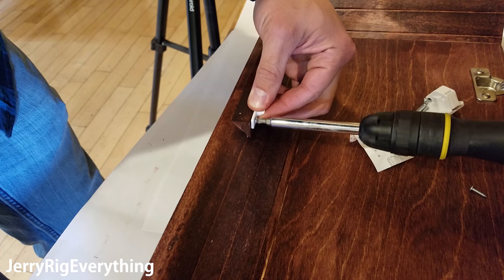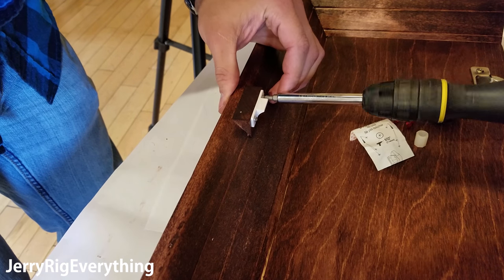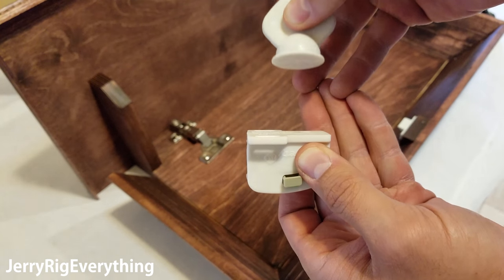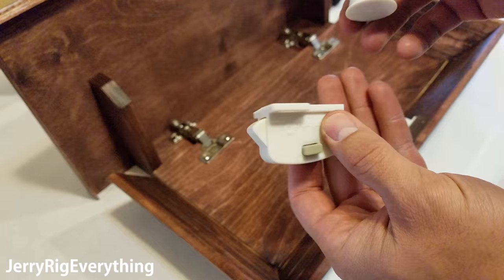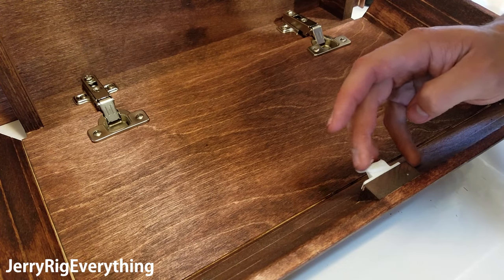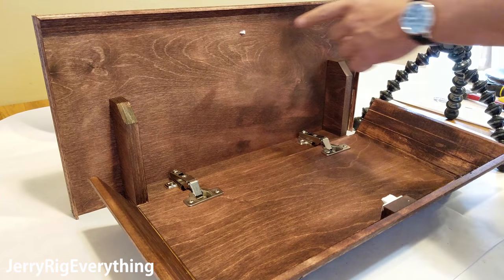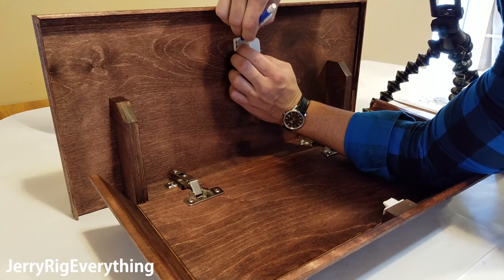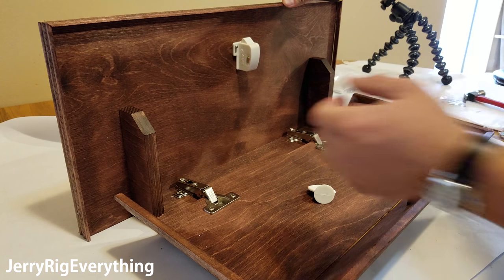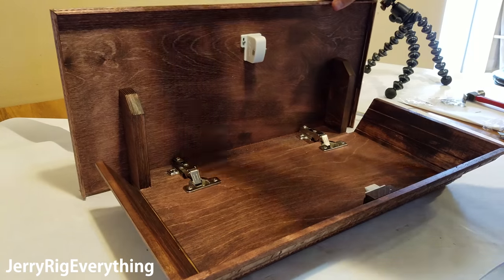Now for the magic. This is a little plastic lip that goes with the locking mechanism. This lip gets installed flush with that little piece of extra wood that we nailed in earlier. Make sure that the top of this latch, the little piece of wood, and the top of the molding are all flat with each other. Here is the magnetic lock — when any strong magnet gets close, it unlocks itself, even through the thick top board of this shelf. Lining this magnetic lock with that little plastic lip is pretty easy. I used the toothpaste trick from Grant's video: apply toothpaste to the top of the little plastic bit, and when the shelf is shut, a dab of toothpaste gets left on the top board, letting us know generally where the lock needs to sit. I marked the screw holes of the lock and then set my two screws in place. It doesn't need to be super exact because the lock can be slid up or down along the screws. So if it doesn't connect with the plastic the first time, adjust it again until the latch is making contact with its little plastic counterpart. Then when the magnet is placed on top, it will unlock, allowing you full access to your hidden goodies inside.